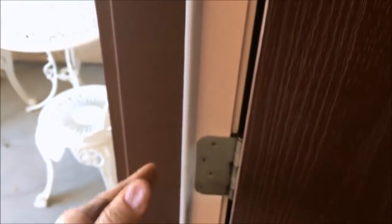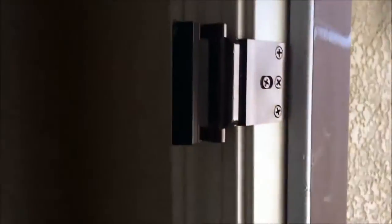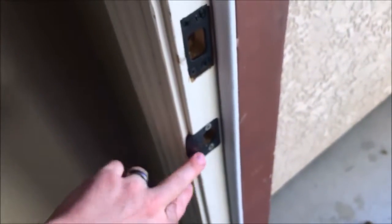This will beef up the hinges, having 3-inch screws that go into the stud. So if somebody tries to kick from this side, it's going to be a lot more resistance. And then with this strike plate, this latch, and this reinforced latch, I'm pretty confident that the door is definitely more reinforced, and if somebody can't break in right away, they'll hopefully move on to the next house.